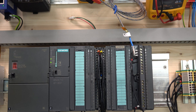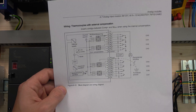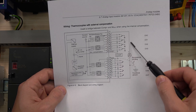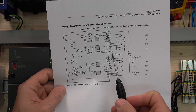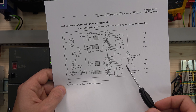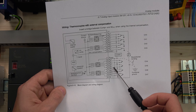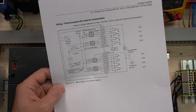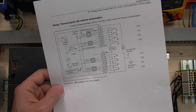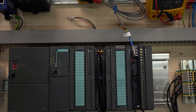The reason we need to know if it's grounded or not is shown in this wiring diagram. Here you can see the wiring for both types. There is something called 'mana' and compensation. For a non-grounded thermocouple like mine, you do need to connect all the minuses to mana. A piece of paper here gives a better explanation.